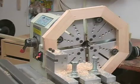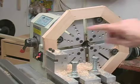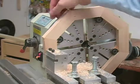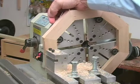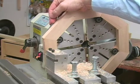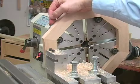The next step in preparing each layer of my block rim would be to round off the outer diameter. Unfortunately, the jumbo jaws are just wide enough that I'll run the risk of running my tool into them if I try that. So it's time to switch over to the internal jaws.